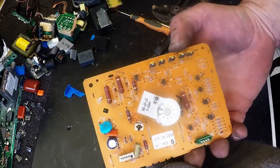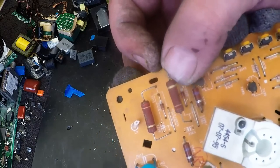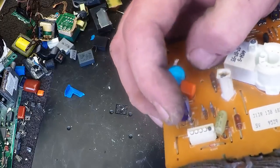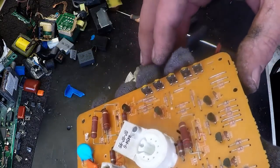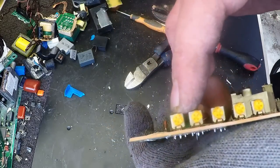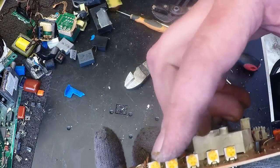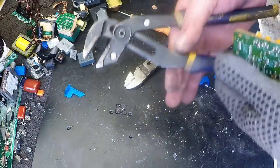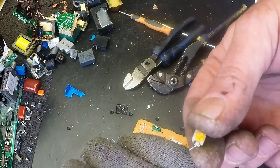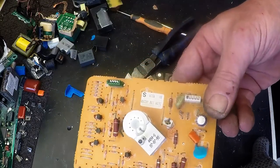That's off the top of a CRT yoke, right? What's on there to depopulate? Well, nothing. You've got pretty little resistors with little gold bands — no precious metals. Capacitor — no precious metals. Nothing there. The only precious metals are these little tiny switches — maybe they'll have a little bit of silver, but they're so small. A lot of people like to keep tactile switches. But yeah, what do you do with that? It's just pretty much scrap metal unless your scrap yard takes circuit boards — sell it as a low grade board, that's all it is.